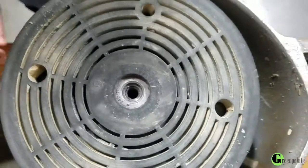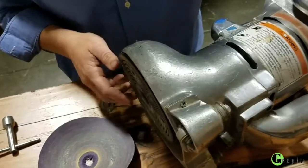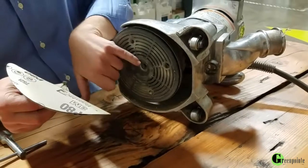So all it requires is a couple things. When you change your paper, lay your edger on its side instead of putting it right upside down. That way the grit and debris is more likely to fall down onto the floor instead of going into your edger.